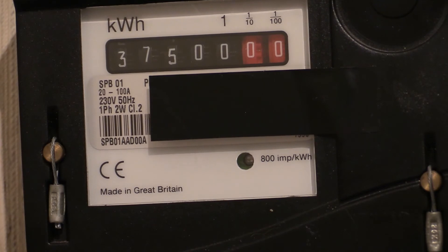The ideal amount of pulses will be 80. If it's on the fast side we can have 81.6 - we'll round that down to 81 or 81.5. For the slow speed we've got 78.4 - we'll round that to 78 or 78.5. All I've got to do is go down to the variac, dial it up which it already is, and just thump a switch on and get that pulse light going. This might be a bit difficult because the meter is up on the wall but the testing instrument is down on the metering board, and I won't be able to see both pulse lights at the same time. I should have put the SPB01 on the metering board, but let's not waste time - let's cut straight into it. It's only a little clicky clacky box anyway, so I'm going to go down to the variac and fire everything up.